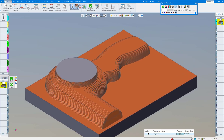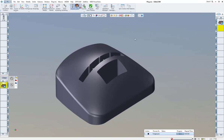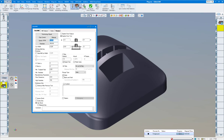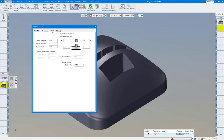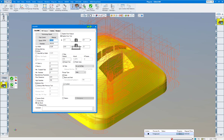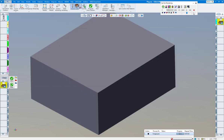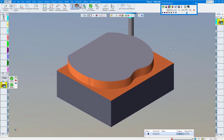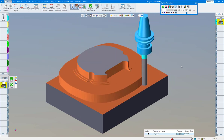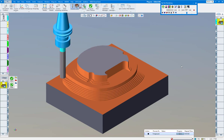Let's go on to the third part. This is a pretty big part — 12 inches by about 12 inches, pretty thick as well. Using a three-quarter inch end mill, going down five inches, inch and a half desired step. I'm going to go to the Solids tab and click on wall cleanup at eighth of an inch. Let's look at the toolpath and do the rendering — pretty aggressive depth of cut. Notice it's going to come up that eighth of an inch and clean up, and of course it's going to do a helix in the hole.